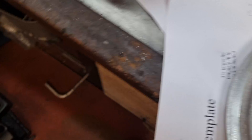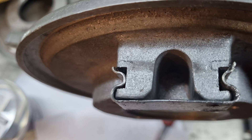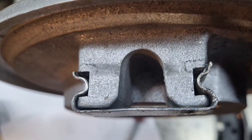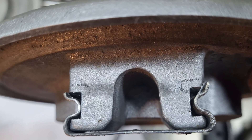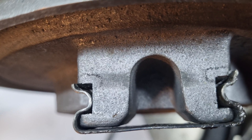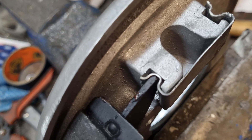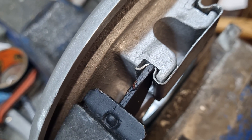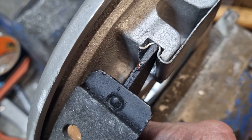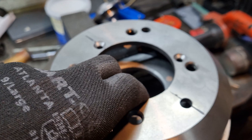One of the last things you need to do is make one of these clips. They're folded around the grooves you cut with the milling machine in the end plate. It's got to take up the ends of the shoe that sits in there, and it should look like that. Basically that will wear better than the bare aluminium.